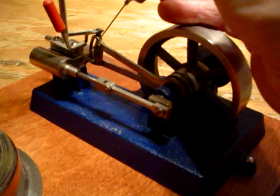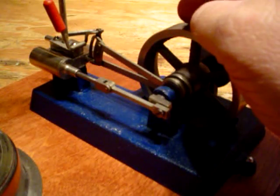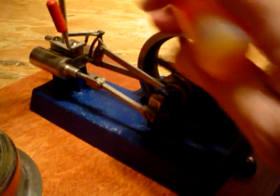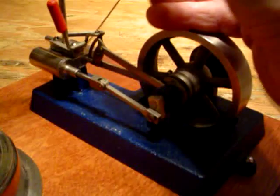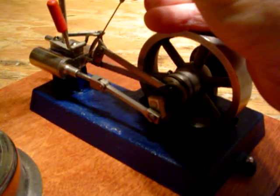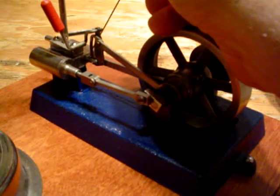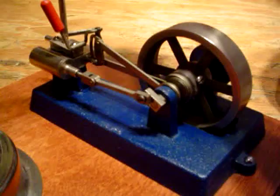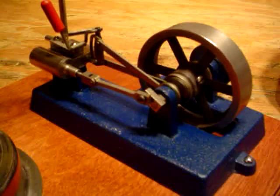As is the rod that connects to the piston — you want to put a little steam oil right around the junction where the rod goes into the end of the piston. Turn that over a few times, do it again. We don't have to do it excessively, but we want to get it coated. So steam oil goes in three places: where the rod connects to the piston, where the valve goes in and out of the steam chest, and through the exhaust port to get oil into the piston cylinder area.